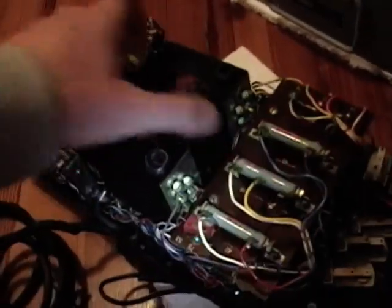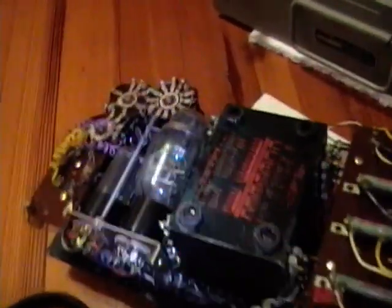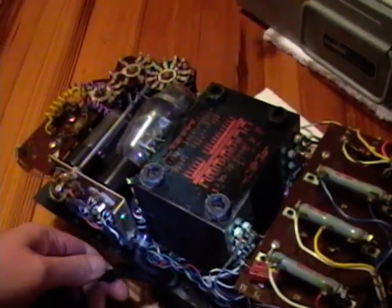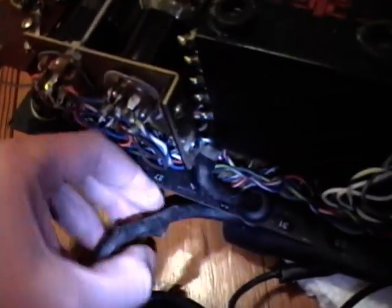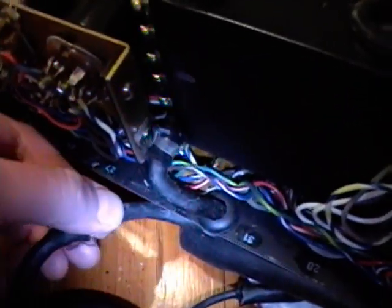There is a special technique for calibrating these — you use a standard tube, a special tube with a known exact transconductance reference point. The only other thing I want to check before powering it up, besides the tubes, is this power cord, which I'll have to replace entirely. The inside looks okay, but the outside rubber is really hardened and just cracks when flexed.